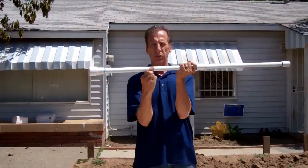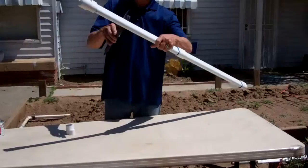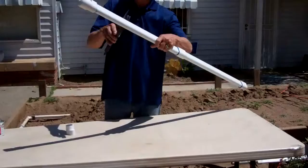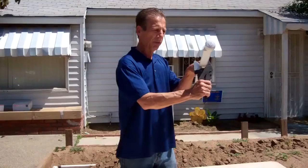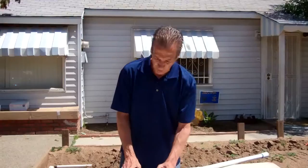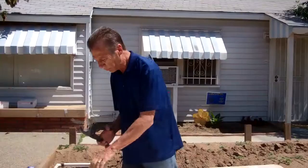In this configuration, you want to put the blade against the small part of the AquaJet because it's really strong down there. The tube is larger up top, and if you put the blade on top it's going to squish and mushroom it a little — you don't want that. Put the blade on the small strong end, start ratcheting down, and you see how it cuts right through with no squishing — just a nice easy, clean cut. If you use a saw you'll get burrs, so the PVC cutter gives you a nice straight clean cut and you're ready to go.